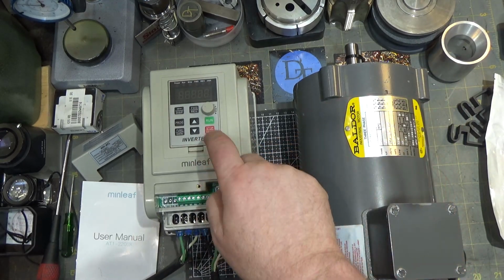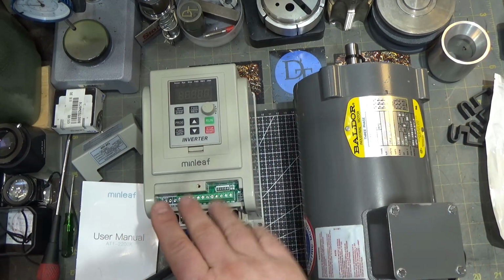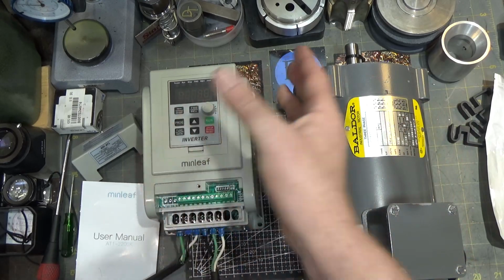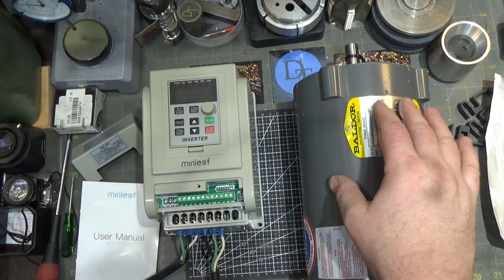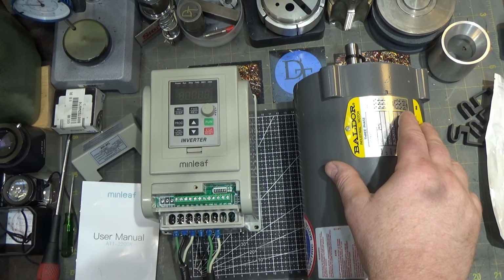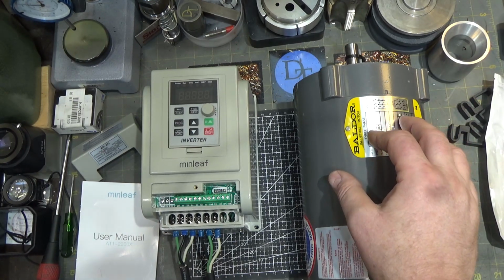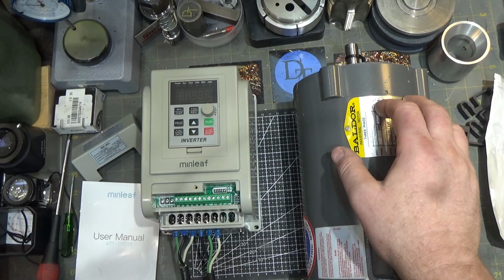In any case, for the money, this is a pretty darn good unit. It's the equivalent of units that are $500+ more, and they have some other options this one doesn't, and they may be a little bit better built. I mean, they're going to have better plastic, and they may use better fans, so if the fans on this die, maybe that could cause the capacitors to prematurely dry out and this thing fail. That's certainly a possibility, but these guys use pretty decent quality components. They use name brand components on a lot of this. The capacitors, I didn't recognize all those brands. I think there's some Chinese brands in there. They didn't use top tier ones like TDK and Panasonic. But still, I don't have much bad to say about this unit.